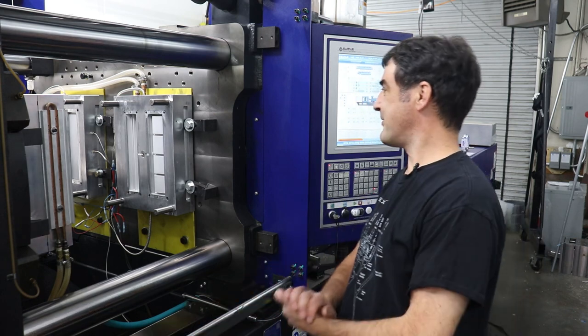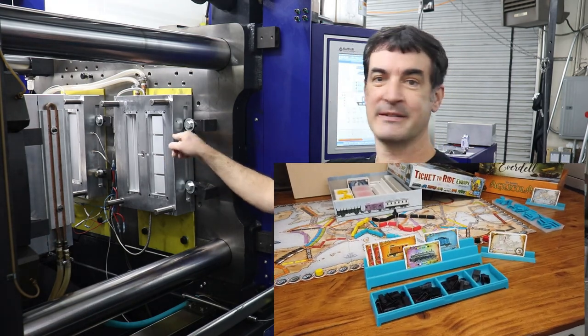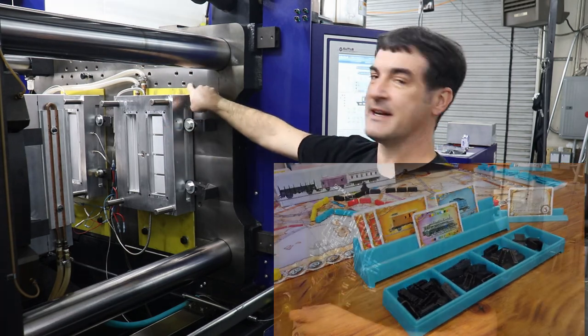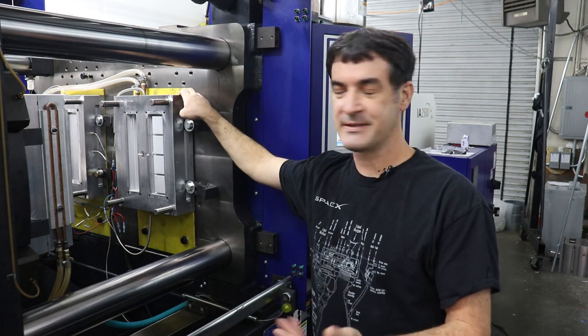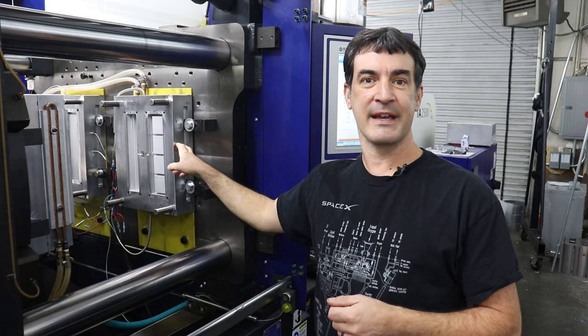And the second half of our episode is gonna be a few key components for production of the Gametamer card rack parts, and that's the set of molds in the machine, one of which is this heat isolator so that we could better control the temperature of the mold for long-term runs, and the other is modifying an alignment ring for both of the molds on the A side.